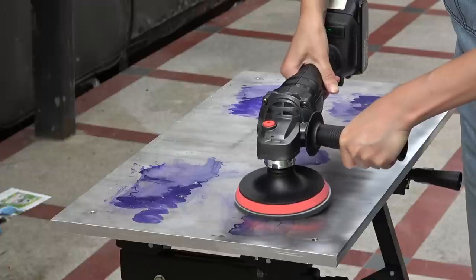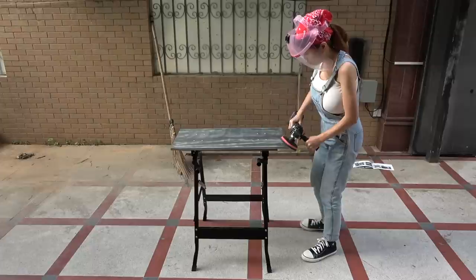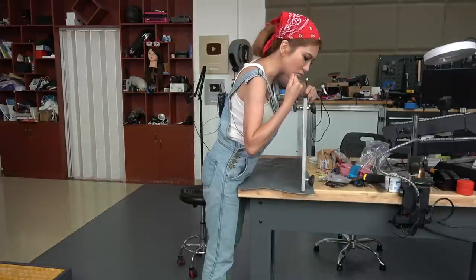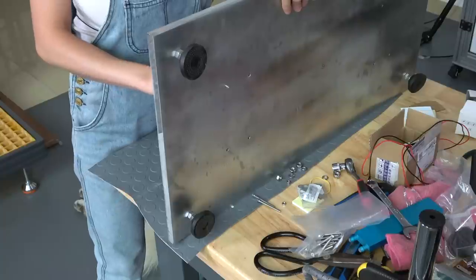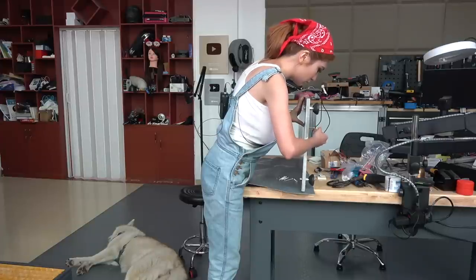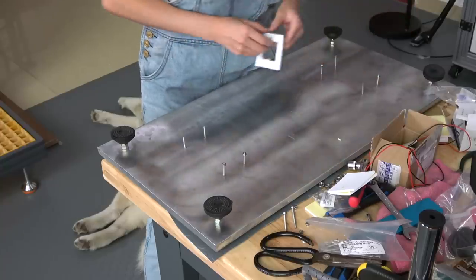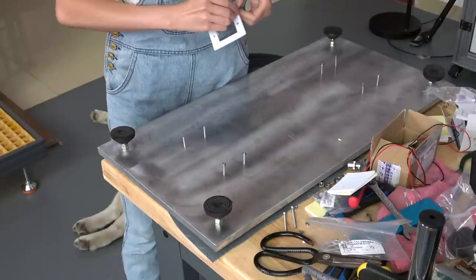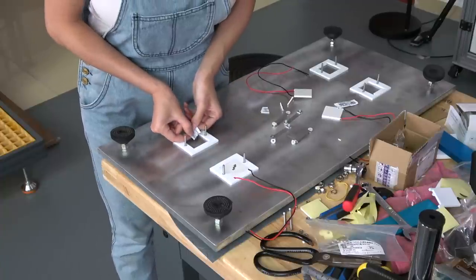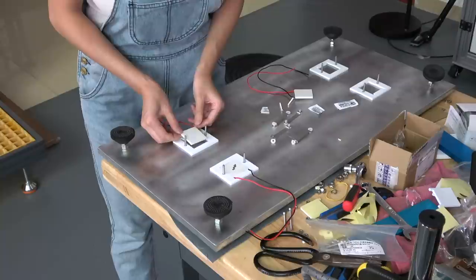I got a discount on the aluminum because it was stained and scratched, so I am just cleaning it up and smoothing it out a bit. If you like the angle grinder, I will link it in the description box. Those foam pieces are just to insulate the peltier junction so there is no heat leakage between the two sides. And you just use a tiny, rice-grain-sized amount of thermal paste — you don't want to make a mess. Don't crush it, just push it down very gently.